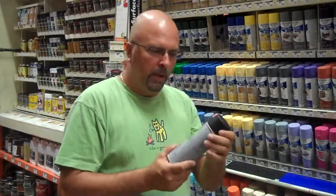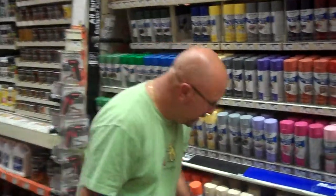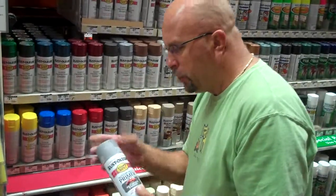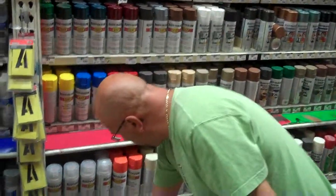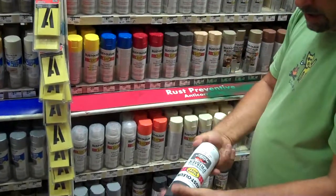Anything without the gloss, other paint will usually adhere to, so this is a great primer — it's flat black paint. If you can't find flat black paint, then try to use gray primer on black fire escapes. And if you can't find it, use dark gray primer.